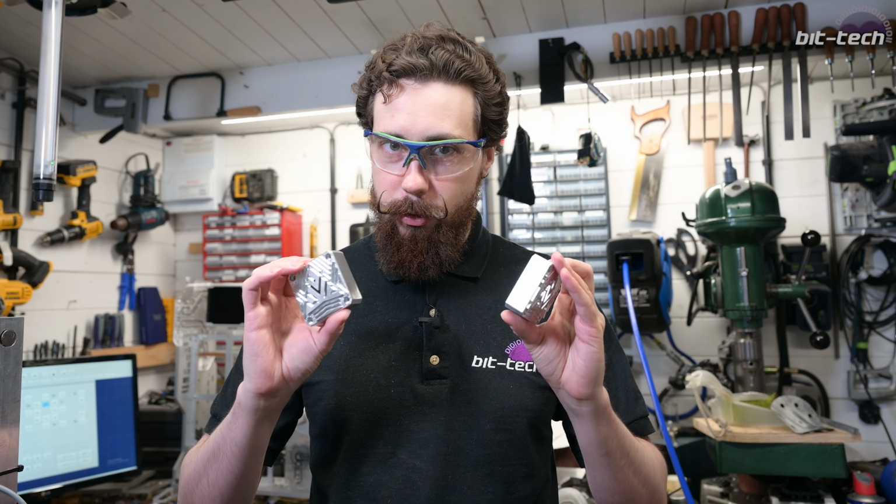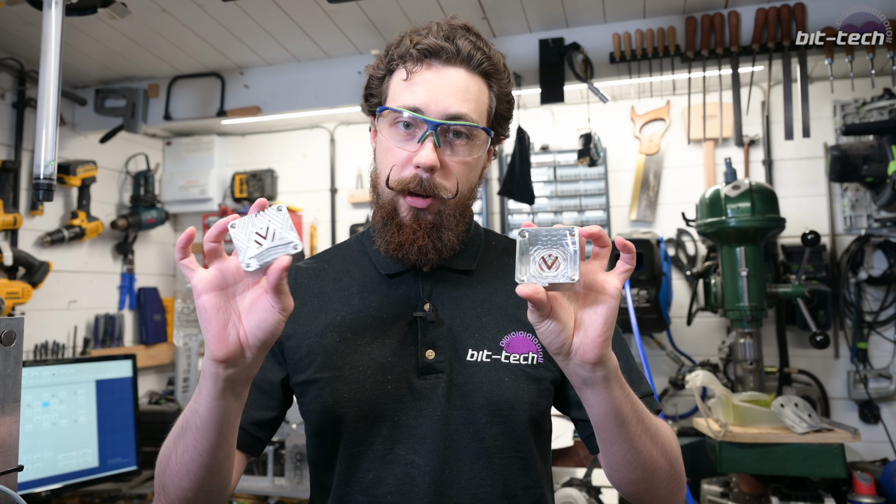And that's no good. Luckily, I had no breakages for those ones. In fact, I did break an end mill. You didn't see it because it just so happened I wasn't filming because it was on the second one. But it was actually the 4mm one, the one which I was least expecting to break. Basically, I didn't quite torque it down enough, and then due to a dodgy Z height that I put in, it cut a little bit too deep, chattered, and then just ripped it straight out. Luckily, these parts were fine, but obviously the end mill didn't do so well. But put a new one in there and it did fine.